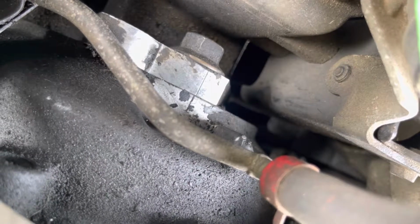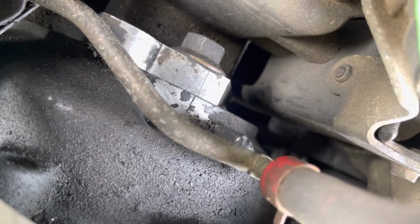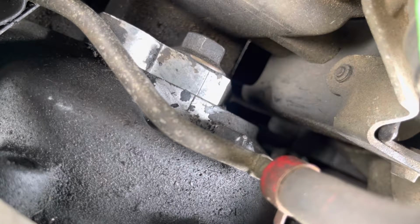When we first got this truck, it was all the way to the driver's side. This thing smoked, it stumbled, it was just terrible. I didn't have any of the timing setups to check it, or the knowledge, or the tools. So we just moved the pump back to a line width advanced, because that's all GM and Chevy and the military ever said to do: just line the lines up and drive it. Maybe if you go a line width advanced, you can get a little more power.